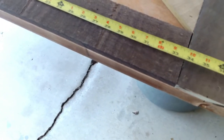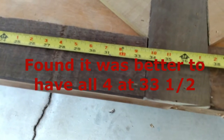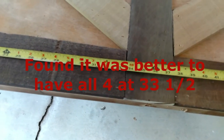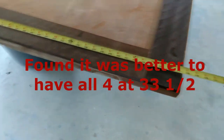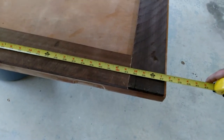For our two lower boards we used 33 and three-quarter inches — though one didn't come out exactly right on that cut, so measure twice, cut once. On the top piece, we made these 33 and a half inches — two of them — and I'll show you why I learned this on the last door we made.